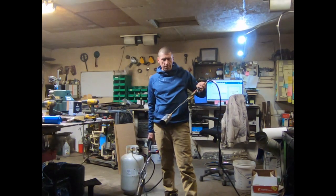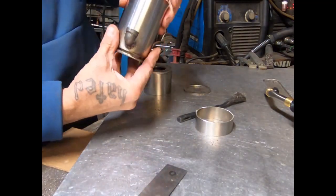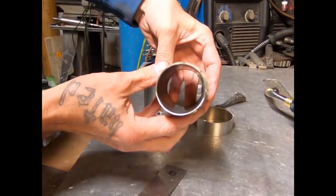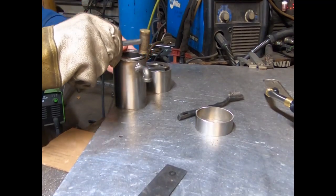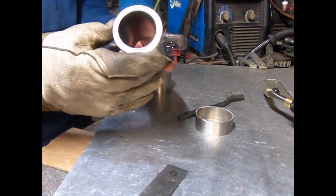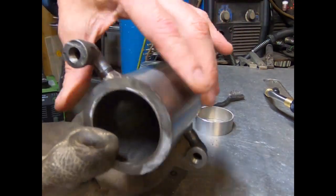When you're using these things a lot in cold weather, the power goes down quite a bit because you lose pressure from the bottle boiling off. Here's a closer look at what we've got going on — there's an inner vaporization chamber. I didn't want to use coiled wire or coiled tubing because the heavy ends in the propane can clog up those lines over time; you have to use very clean propane to run that kind of system.